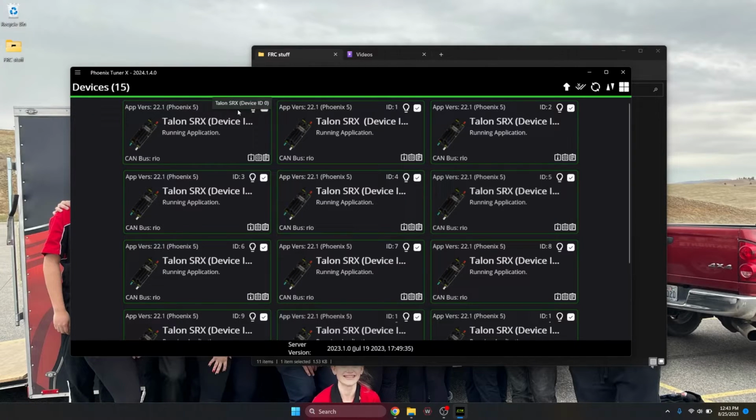I would say, contrary to how this robot is set up, avoid using ID 0. The reason why is that when you put a new device in your system, when you hook it up to the robot, it will, from the factory, generally have an ID of 0. And so it can be a little confusing. If you already have a device on the robot that is ID 0, then they start to conflict with each other, and you've got to figure out which is which.